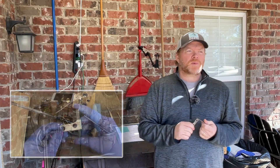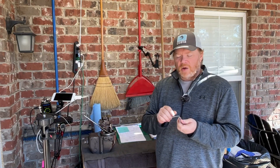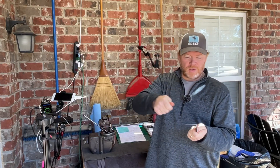Up in the corner I'll link to a video of Barry's — the man from the mist. He made one of these and went through the dimensions and everything as well. He used a reamer to ream out these holes and get up to the right dimensions, and I didn't have a reamer when I made the other one, so I was just having to wallow through with the drill and try to get it close. That didn't work at all.